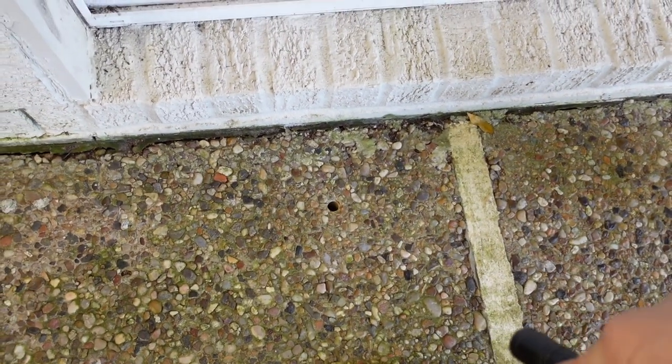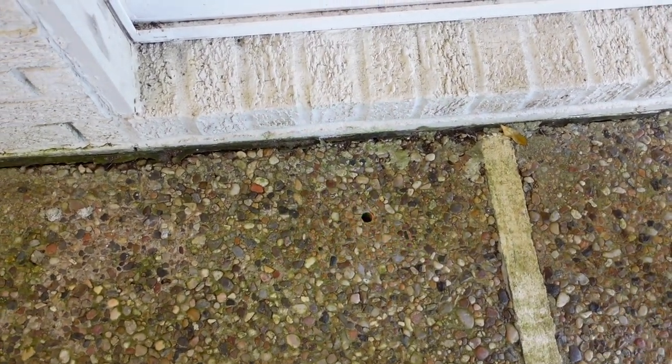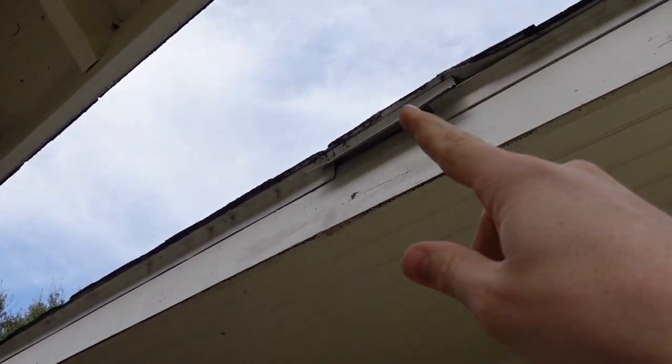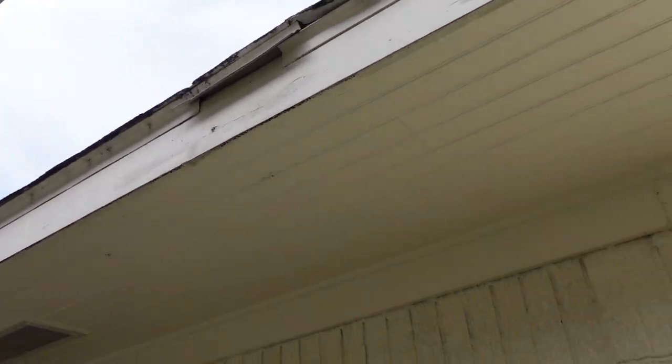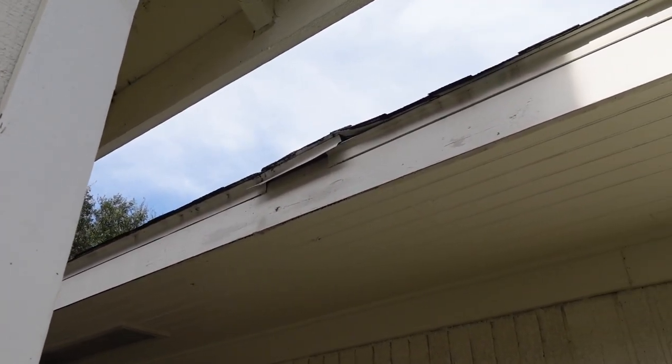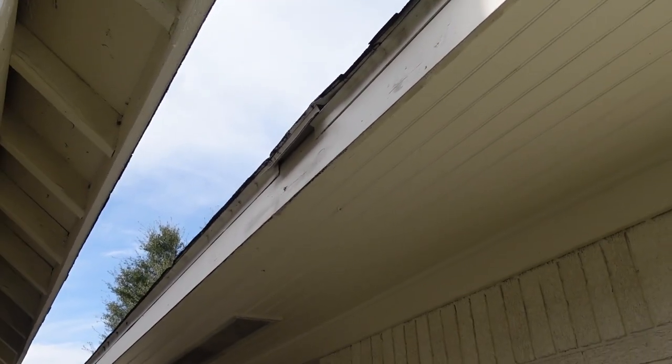Here's a better look at what a termite treatment hole looks like. As part of doing two passes of the exterior, we have some lifted drip edge flashing — an easy area to get some water back into the soffit area. It doesn't look like it's caused any immediate damage right now, but it's an easy call-out and an easy area that should be repaired.